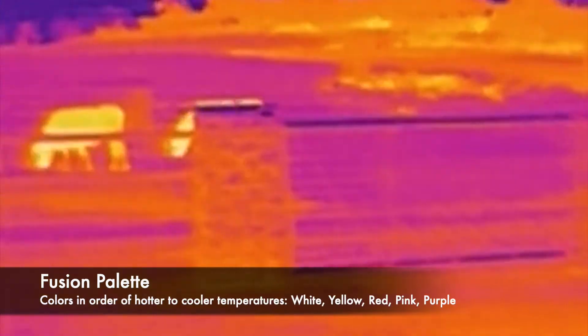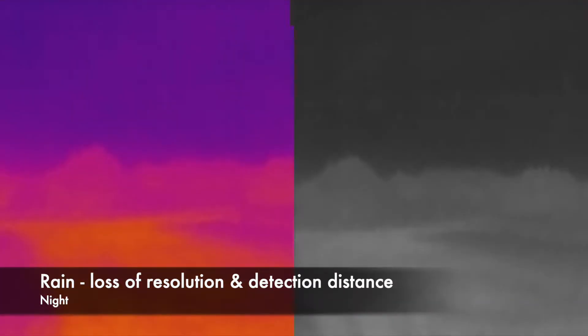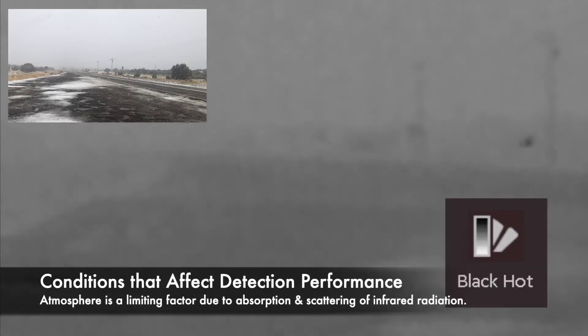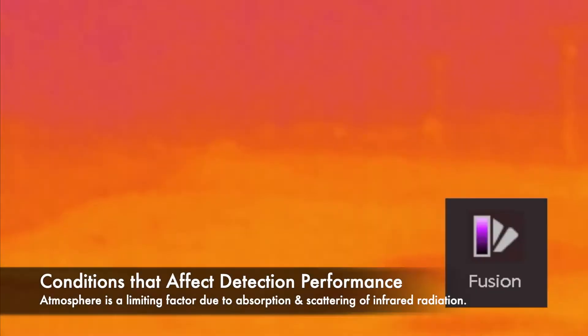There are four color palettes: Fusion, Red Hot, White Hot, and Black Hot. I liked the Fusion palette to scan and detect, then Red Hot to confirm a hot target, and I really liked Black Hot as I seemed to get a lot more detail and recognition from it. During rain, fog, and snow, I lost a lot of resolution and detection distance. In snowy conditions at freezing temperatures, I got some of the strongest heat signatures on humans within about 60 yards, probably because of the significant temperature differences, with best recognition within 50 yards on humans and approximately 100 yards on vehicles. Fog, snow, high humidity, and scattering radiation limited the thermal's ranging performance.